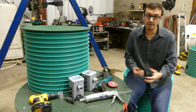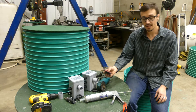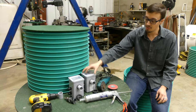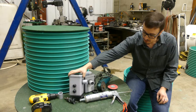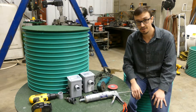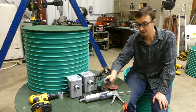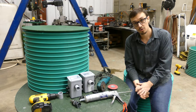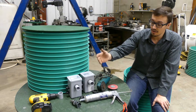What you'll need — and you can improvise — but we're going to use a grinder with a cutting wheel and a sanding disc. We've got a couple of splice boxes on the table: this is a six-cord splice box, otherwise known as an SB6, and this is a four-cord splice box. The conduit sizes on these are actually two different sizes, so that has a big impact on what size hole saw you'll need. There is a sizing chart we can put in the description.